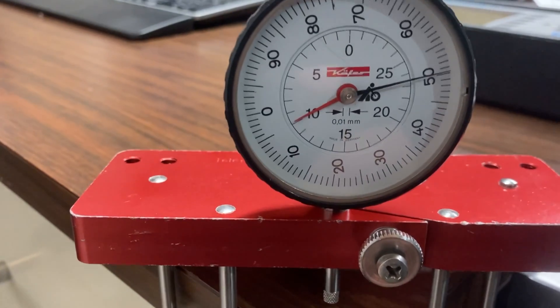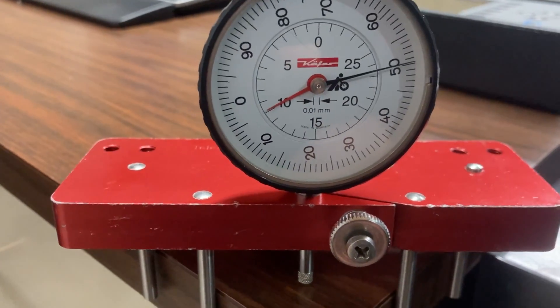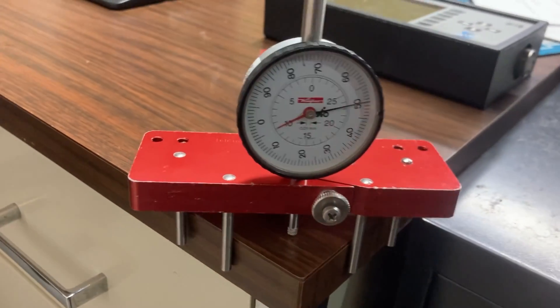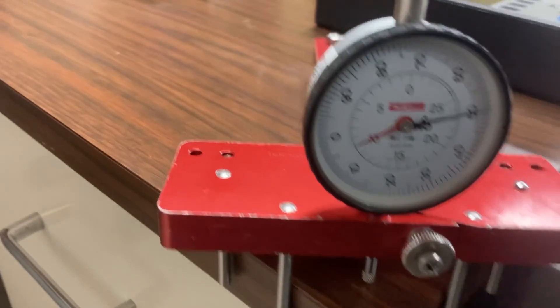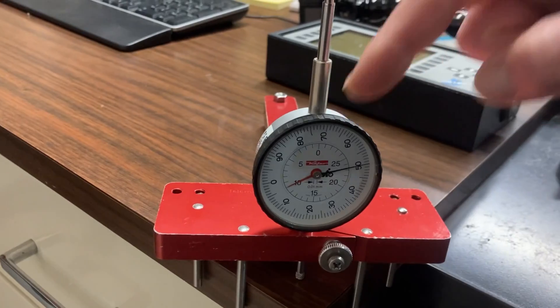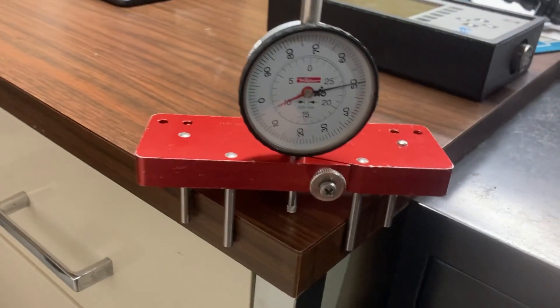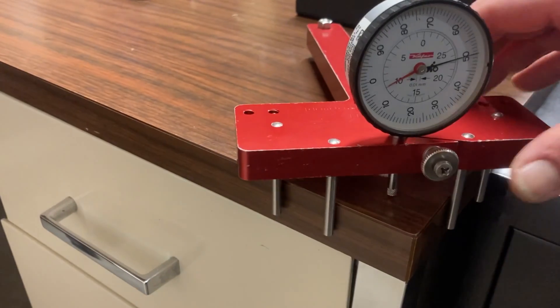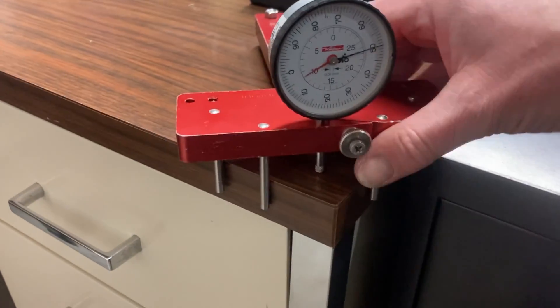9.5 — complicated? Not really. After you set it to 9.5, wherever you are on any corner of a table it's going to be different, but once you set it there, don't change the bezel. If you change the bezel in the middle of your tracking, your numbers are not going to be the same.